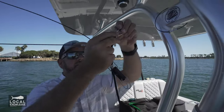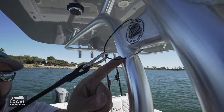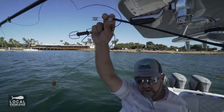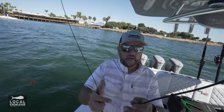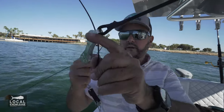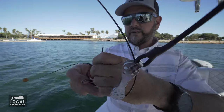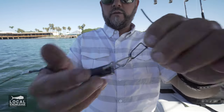Next, I need to install my snubber. I put a small piece of the same outrigger line crimped onto this cross pipe. What that does is it keeps all the rigging for the outrigger up overhead so you're not going to hit your head on it if you need to run up the rail and cast on a fish. Since this is my long line, I'm going to thread it through the back wheel on the snubber. Put a crimp on, put my swivel on, and snap the swivel onto the release clip.